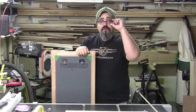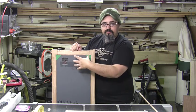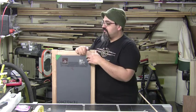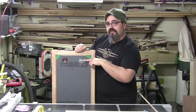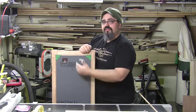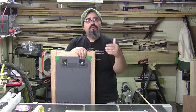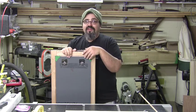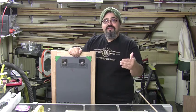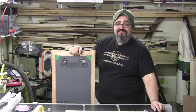One more option is simply taking some brads and shooting them into the actual wood itself to use those to hold the mirror in position. It works on the same exact principles as all the other things we've seen. Just make sure the brad is shot in at an angle and then slightly bent down so it'll hold the mirror — you don't want it too steep where you'd end up nicking the glass itself. Maybe even come back with some tape. One suggestion was: could you silicone it in place? Absolutely — but remember, it's a matter of how easy you want it to be to remove somewhere down the line, because stuff happens and you're probably going to have to fix it at some point.